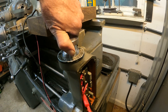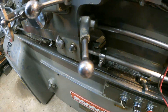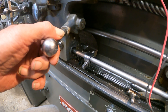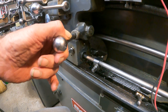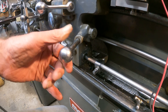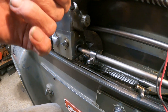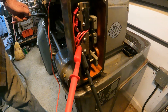We'll put that in right-hand threads. Now this is the apron lever and it's got three spur gears. Here's the dog, and I'm going to move this lever — watch that dog. You see how much that lever moves before the dog moves? You've got a little bit of slop there and you have to contend with the slop in the system. There are three gears and it moves this rod, which comes over here and works those switches.